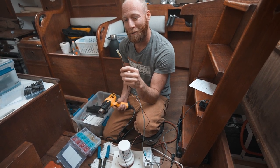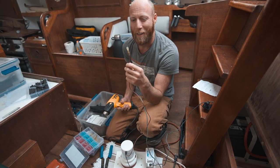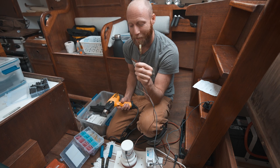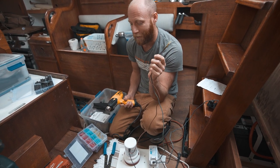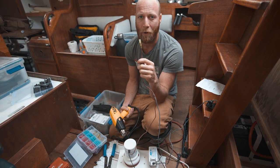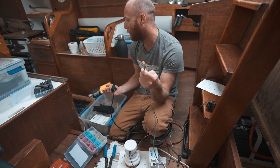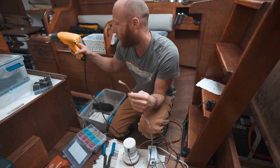Normally you shouldn't try to squeeze two wires into a butt connector like this. It's best to use a terminal block, but this is going to be so far down in our bilge it's just not very functional — I don't even know if I can fit in there to install a terminal block, so this is going to have to do. Deal with it, Don Casey.